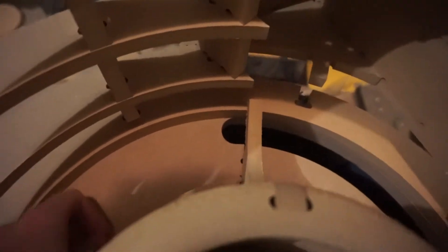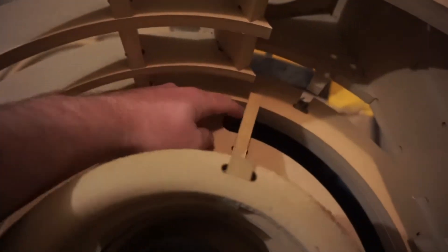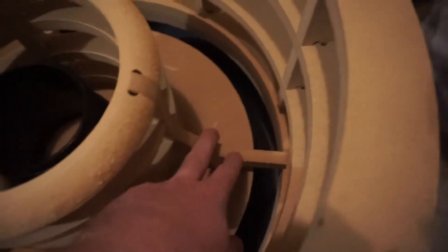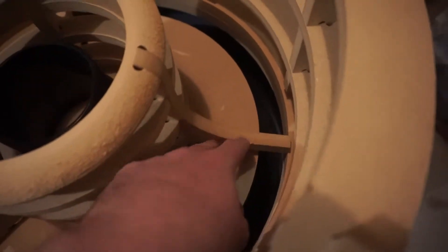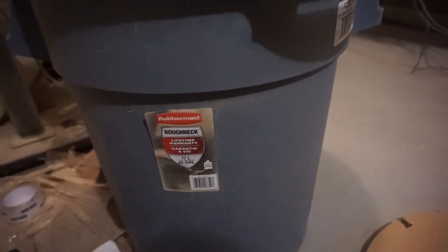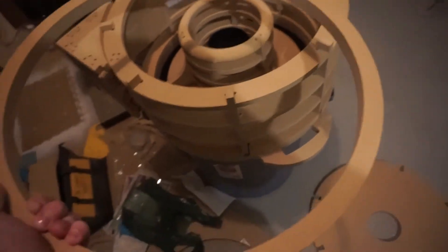This being the last slot, I've got a little hole in this side so that dust can drop down there. The point of these pieces is to support the center section and also to decelerate the air which is a bit lower down, to hopefully drop more of the dust down into the bin underneath. It's just a really cheap Rubbermaid bin from Home Depot or Lowe's. I have actually cut the ring to go inside there - this will go underneath the cyclone and into the bin.